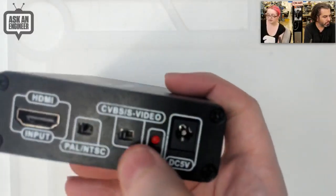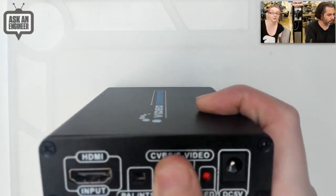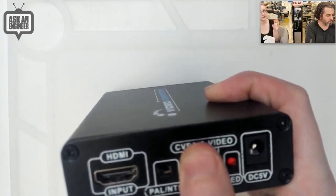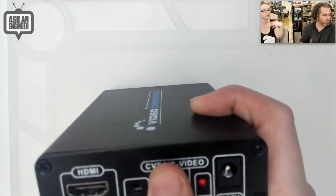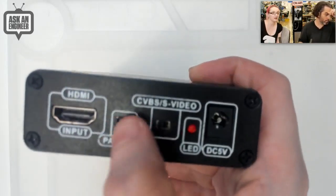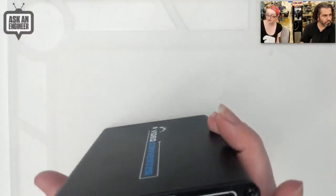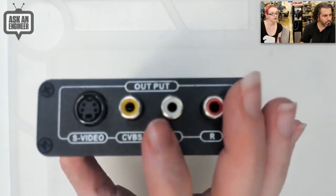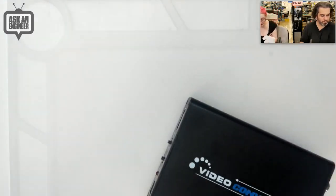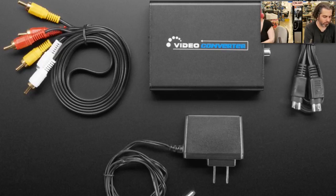You can select whether you want composite — single wire RCA — or S-Video. S-Video does give you better quality because it separates the chroma and the luma: the color and brightness data is separated. So it does look better than just single RCA NTSC or PAL. You can also select NTSC. There's a little LED that tells you it's on. Plug the HDMI in, it automatically detects the resolution and pipes out S-Video or RCA CVBS. You also get stereo audio. It comes with a power adapter and the S-Video cable, plus a really nice gold-plated RCA cable, so you get kind of everything you need. This is a more complete kit. If you have something with S-Video, go with that — you will get better performance.